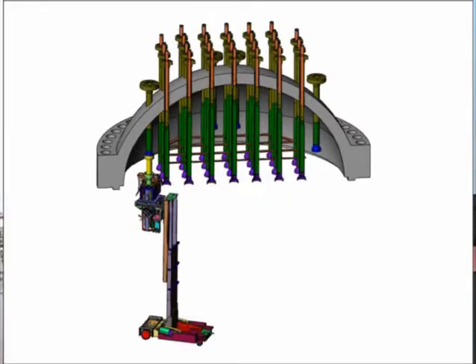Our nozzles aren't just straight pieces of nozzle or piping material — they actually have tapers, and you've got weld warpage and all sorts of things that you've got to deal with to get a good inspection.